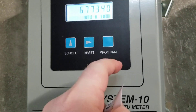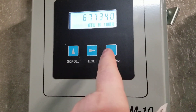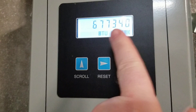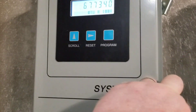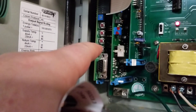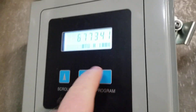What you will do is you're going to go into the program mode to make the change. If you've never done any kind of work on these, most people think you just hit the program button — but when you press that button, nothing happens. The way you are able to get into program mode is you must first enable it. On this particular model with this motherboard, it is the second button up from the bottom. You just press it once and that will enable the program mode.